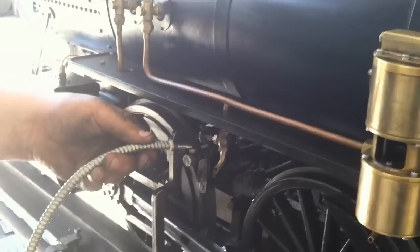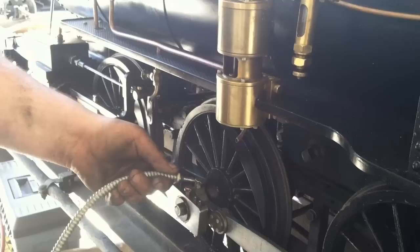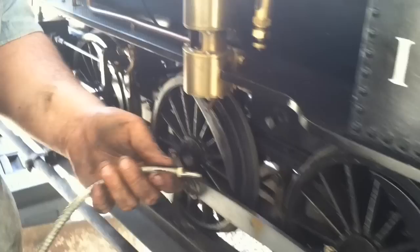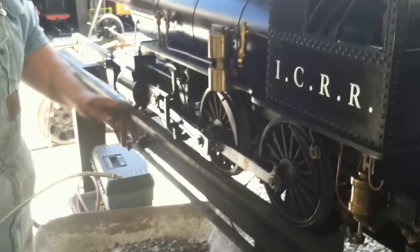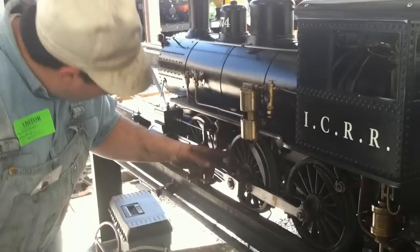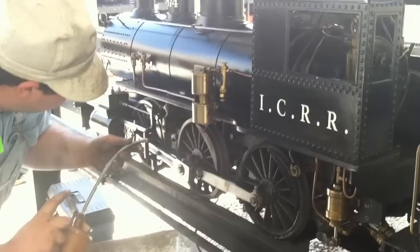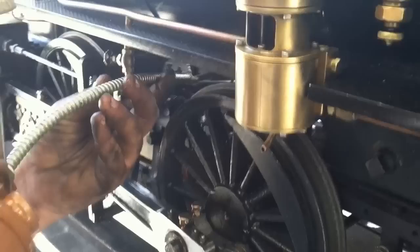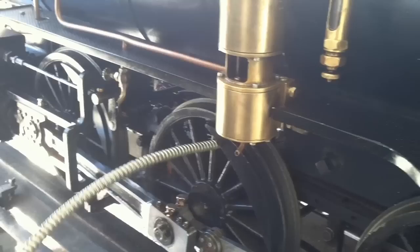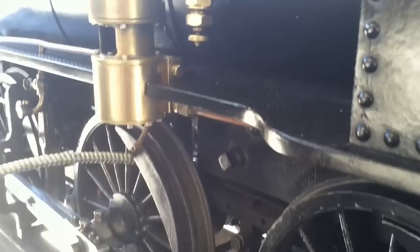We also need to put some oil here on the eccentric line coming off from the valve. This locomotive is equipped with Stephenson valve gear, which means all the inner workings are right in here between the frame. We need to go through and oil all the oil points inside the frame — just little oil cups, one on each side. You get the slides, the pins — that's all you need. You also need to get the individual cams, which control the valve motion as the engine travels. There are four in there, and sometimes you can't get them all right away, so you'll have to move the engine just a little bit to reach the other positions.